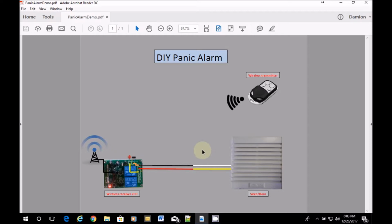Now if you use a long range antenna option, you just join the antenna onto here, either by soldering or by connecting, however you choose to connect. You have a long range antenna. That range significantly increases to anywhere between 1,000 to 2,000 feet, depending on obstructions, position, placement, and all that. So there's your options.